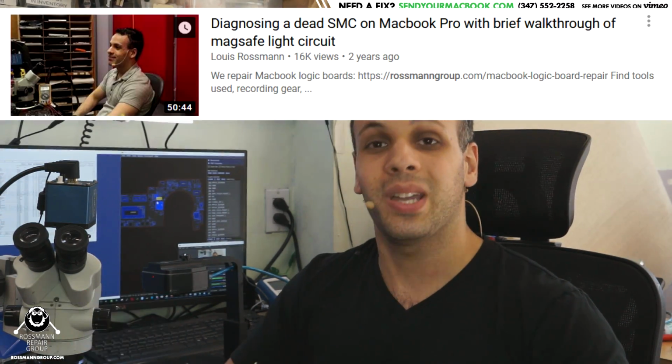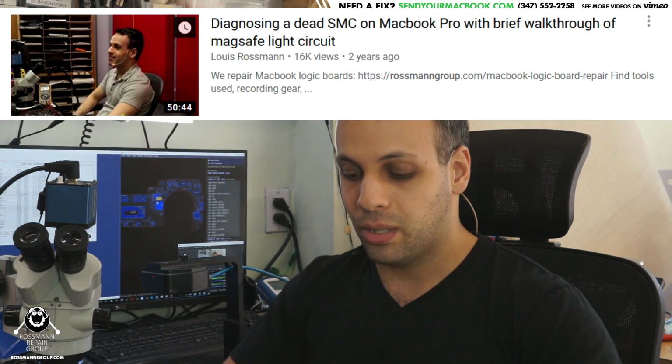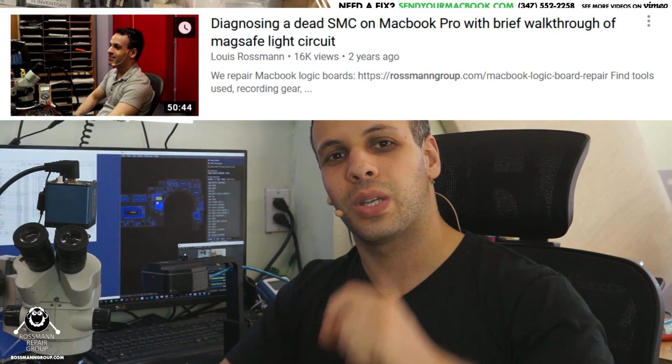Now in older videos, you may have heard me talk about the fact that the System Management Controller comes with programming, and the programming on that chip is not programming that I have access to. I can't just buy a new chip and program it, which means I have to go through dead boards and pray that they're dead for a reason other than the SMC, take the chip off the board, put 96 new solder balls on it, and solder it onto the board to figure out if that SMC is good, which is a pain in the ass, especially given that you don't really know if the board is doing something to make that SMC not work. But at the very least, it's doable. I have to find a donor board that's identical in model, and once I find a donor board that's identical in model, I can replace the SMC.